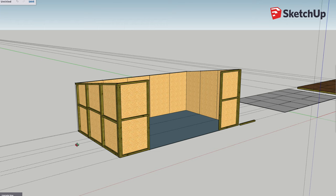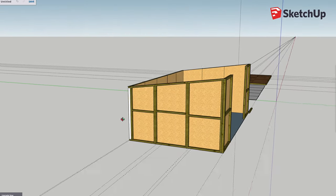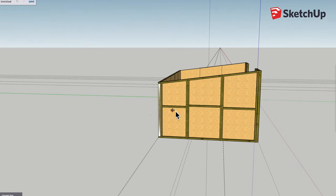And you can see the simple design here of the modular construction of the walls. Now the front ones represent full boards, so that's 8 foot high, 4 foot wide, and it's lined with treated 3x2 timber with a supporting batten in the middle. And as we move around the sides, you can see it just drops down. The actual back panels are going to be 6'6", which gives us the angle dropping down.